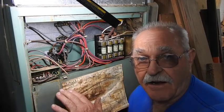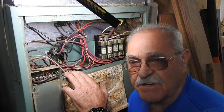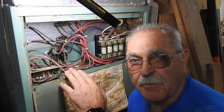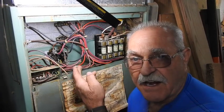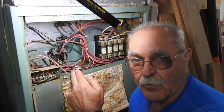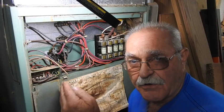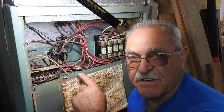This particular case here, this is an electric air handler, and it's an older one. When I first got here this morning, power was off, so I went ahead and turned the power on. The thermostat's in the off position, but immediately the blower started running. First thing I've done is go ahead and check the electric consumption and saw that the switch that turns the blower on was passing electricity. But this particular sequencer or switch also turns on the first stage heating element along with the blower, and that switch is stuck.